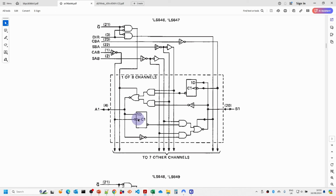What we can see here is we've actually got 2 latches, so 2 flip-flops, both clocked negatively, and the outputs are in fact inverted. So you can see there's an inverted output there, but also the input here is also inverted. So we've got an inverted output there, but in fact the gate at the end there is also inverted.